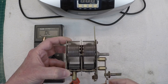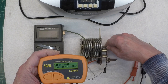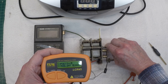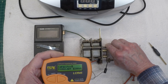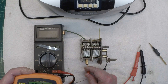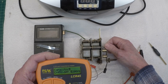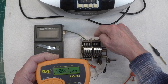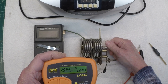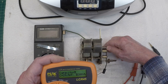Let's check the capacitance range of the tuning condenser. With the plates wide open, we're reading 30 picofarads. Closed up, we're at 450 to 460 picofarads — around 452, so it's pretty close. The trimmers on top will add or take away capacitance as well, and they'll need to be adjusted when we do the RF alignment.